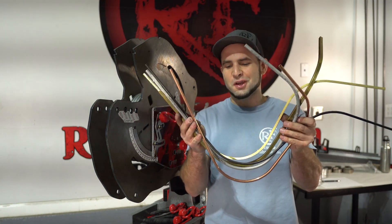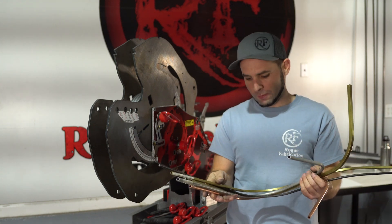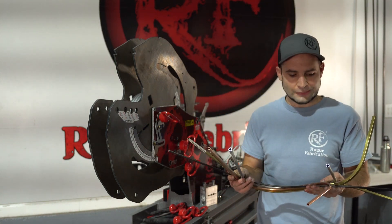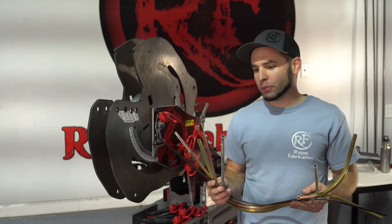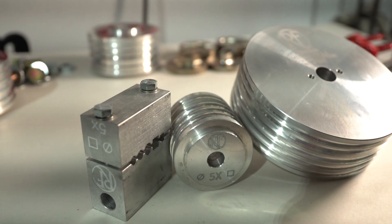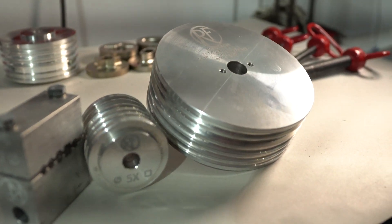As you can see, we've got quite a variety in our bends here and these were all done at the same time. Although, in actuality, with the different amounts of spring back, you couldn't likely make anything to any engineering or production drawings in different materials at the same time. But the similar alloys — in this case, the brass — actually did have similar spring back amounts, so you might be able to pull those two off.